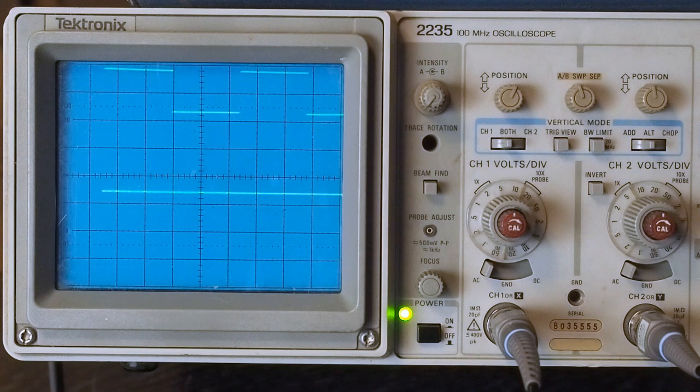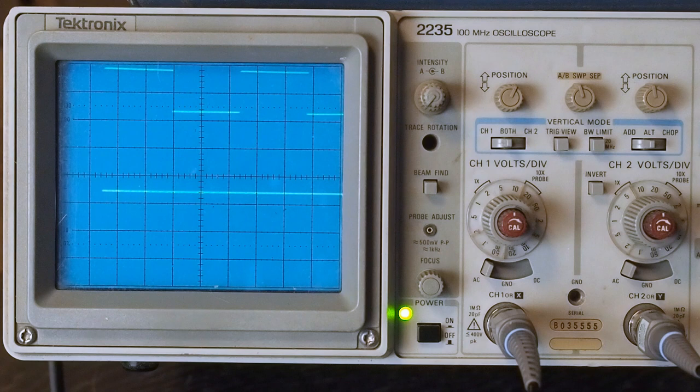Now you can get into checking at a bunch of different frequencies and looking for issues with the amp at different frequencies of square waves, but I feel like this audio analyzer suite is going to bring up any kind of abnormalities that we see at the other frequency ranges. And that one looks good too. It's nice and squared off. And I'm happy with what we're seeing here. It's replicating the square wave quite nicely, which, like I said, a lot of amplifiers really have issues or struggle with.